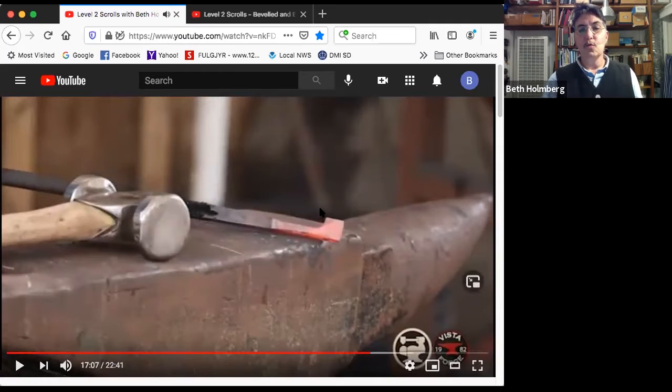Okay, so I've got a really square finial there. So I've gotten cuadrado. Four square corners, four sides that are parallel to their opposite and square to each other. The distance here is the same as the distance here. So that's a great square. And I've knocked the edges off just in the first inch or two so that when I put the secret twist in here, I can keep it a secret.